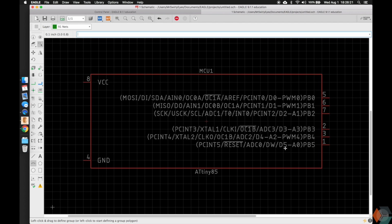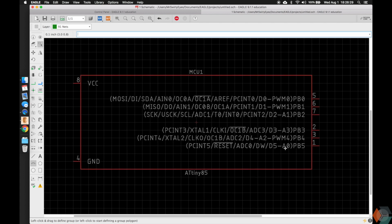You can actually program this chip like the Arduino Uno or any other Arduino device in the Arduino IDE, and when you program the Arduino, it has pins labeled, right? You know, pin 0, pin 1, A1 for analog, A2, A3, and then they have PWM pins, which are actually the same number as the digital one. You just, in your code, use them in a PWM or in an analog fashion. So here are the actual pins you would use if you were to program this in Arduino, and there's a whole other tutorial about that you can check out.